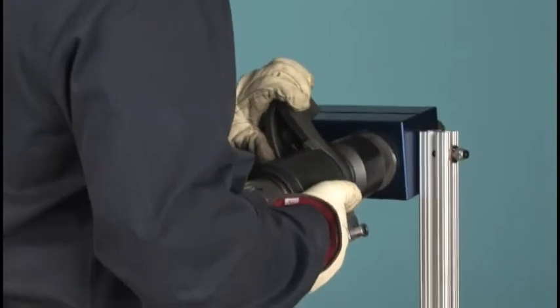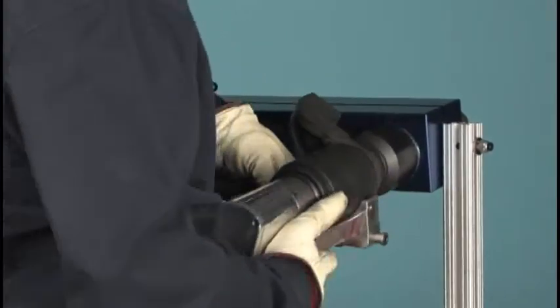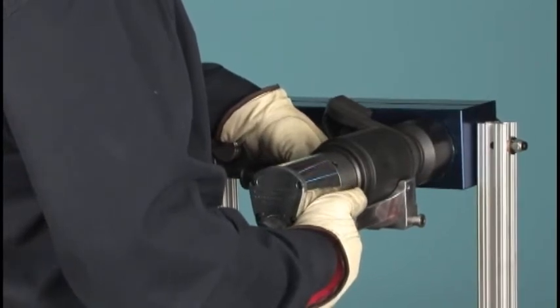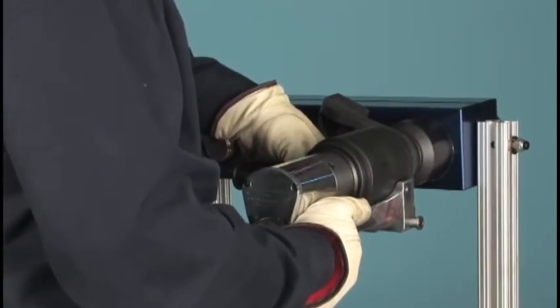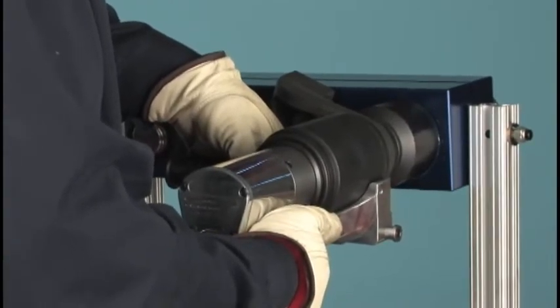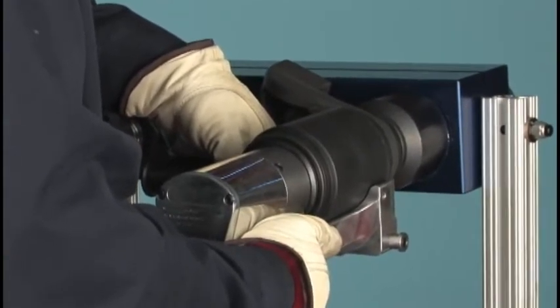Note, your bolting plan may require tightening in increasing steps. If that is the case, simply adjust the air pressure accordingly for each step. It is always a good practice to make a final check pass on all nuts because tightening one may change the achieved load in its neighbor.